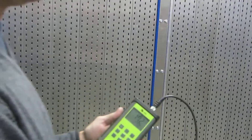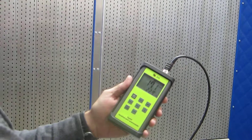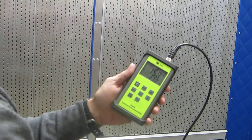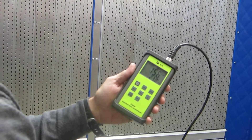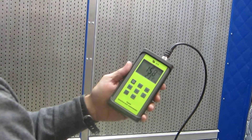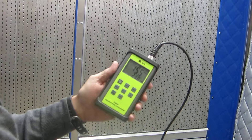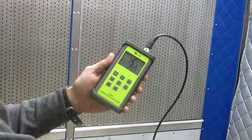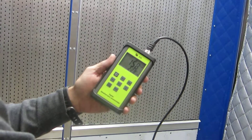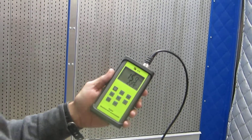And now at the front of the booth — this is the front face of the booth, which is an important measurement to take. From an industrial hygiene perspective, you're going to want this anywhere from 80 to 100 feet per minute. Typically we design our equipment to be anywhere from 125 to 150, so we like to exceed that to ensure we're properly scrubbing the air of any dust or fume. You see there — that's the face velocity at right around the mid-150s.